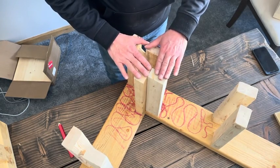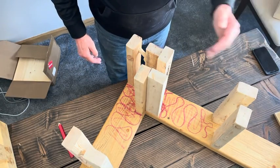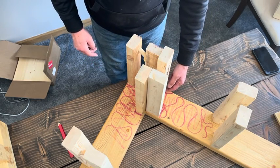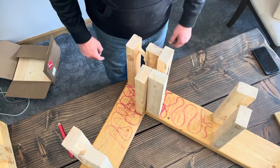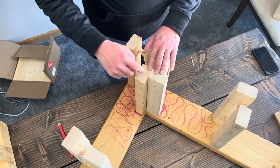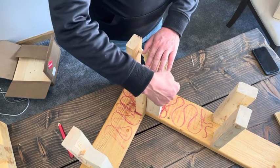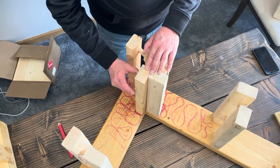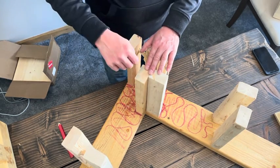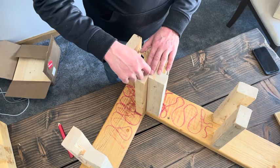This is the corner all finished, and I'm going to take it apart for you. Run your studs this way, run the studs that way. I turned this bare-naked T-stud around this way so I could nail it together in the field easily with a 3½-inch nail gun. This is your nailer for your drywall — you're going to have a little harder time doing this because your 3½-inch nail gun won't quite reach it, nor can you get in behind. So you're probably just going to run some screws through here. This will already be fastened, either a 2x3 or a 2x4, in this wall at the bottom and at the top. You've got to pinch this thing together, so just grab some screws and screw it together to suck it up tight.